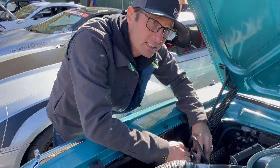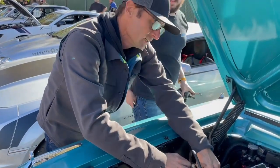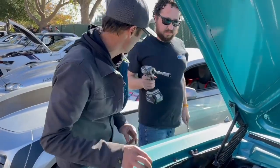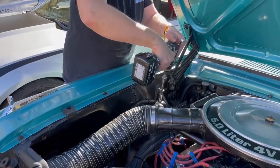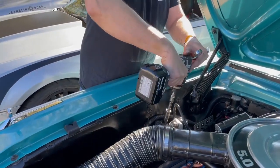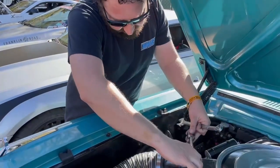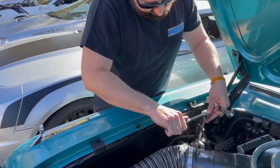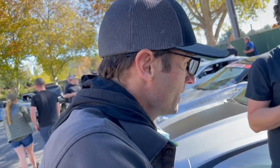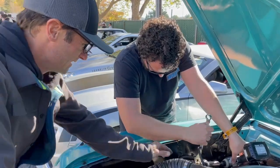A lot of our designs that Craig and I have come up with over the years are really surrounding making sure that this stuff is easy to use — that's really important. So that's another thing: when you're trying to hustle and get a job done quick, take your time at the end, slow down, put a hand wrench on it and feel it. I just don't trust the impact to put the torque on — I don't like running it down and breaking bolts, so I snug it up and then I come back and give it a final kiss.